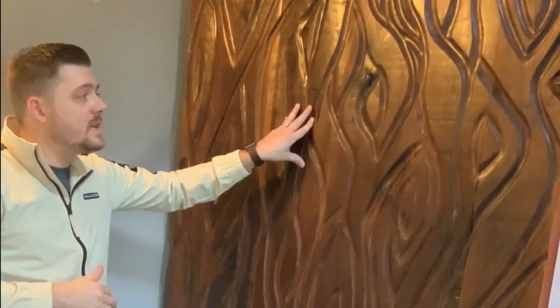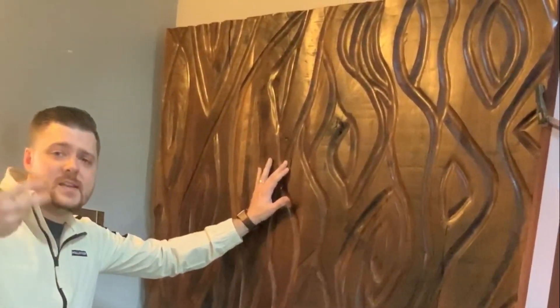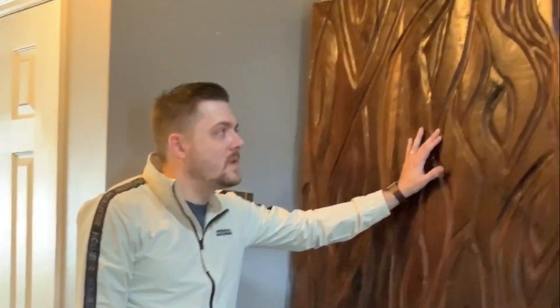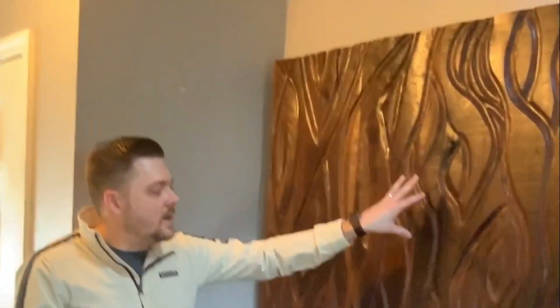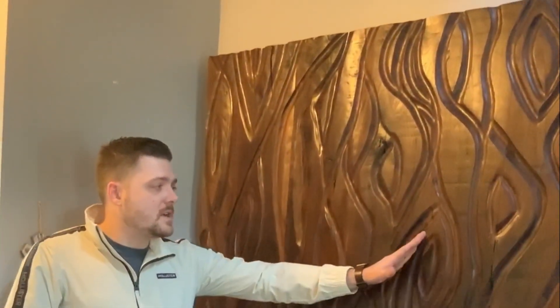When it came to sanding I had a lot of trouble. One thing that really sped it up was those Brillo pad sponges — they make them in a couple of different grits, usually gray, green, and white. I used the coarsest I could get to work into the grooves. I also used 80-grit sandpaper wrapped around different diameter pieces like markers and pipes. I've got a spindle sander and used the different diameters for that. Rockwell makes some specific tools for this too — expensive, but I might get one in the future.